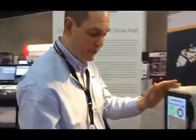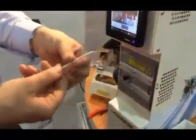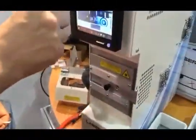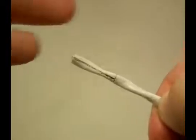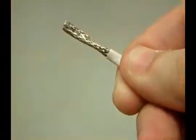This machine is very powerful. Not only can it strip across the wire, we can also strip along it. We take a twisted pair, which is difficult to strip mechanically, click it over to the fourth position, put the wire in, and we see it strips across and down the cable — creating a slit which allows us to peel off the cable jacket as easy as that.